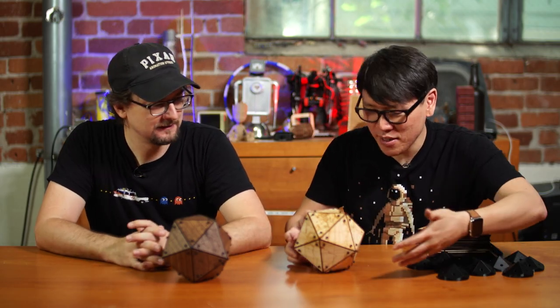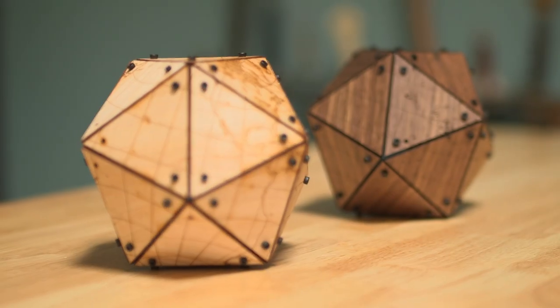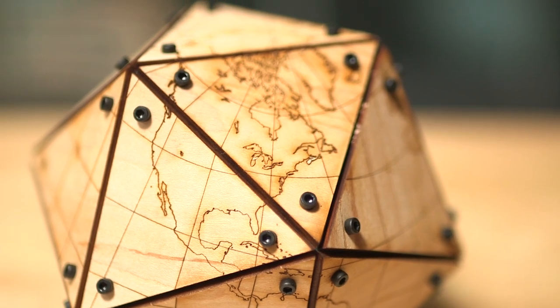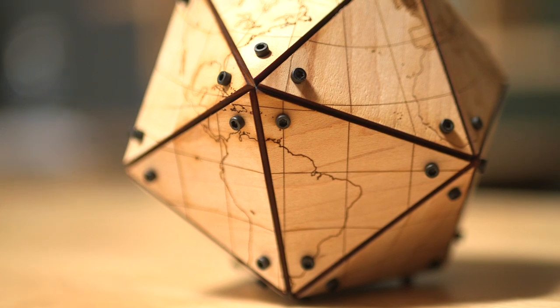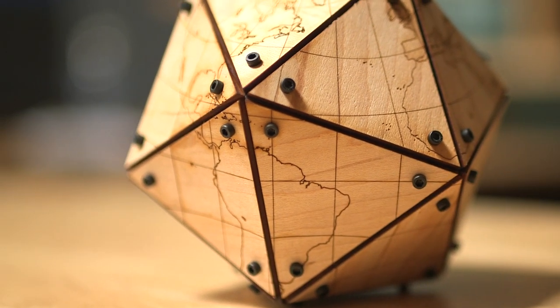But eventually got it solved. It looks almost exactly the same. Looks pretty good. Actually, I love the finish of this one, but I like how well you can see the contrast on this one. Yeah. And up close, so this one did have the contact paper. It's very, very minimal scorching. Those presets, setting it to just that hardwood preset, worked well, and it does use all three of the types of cutting we can do with that laser cutter.